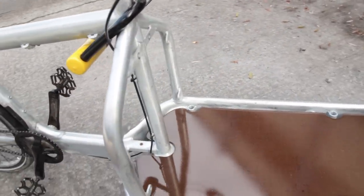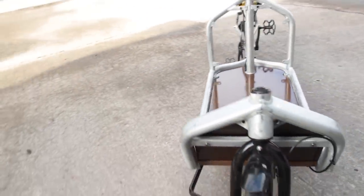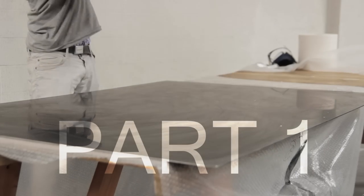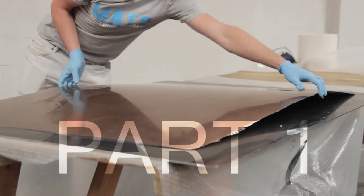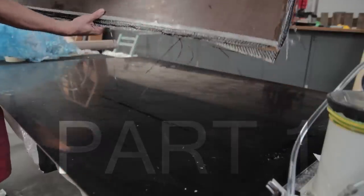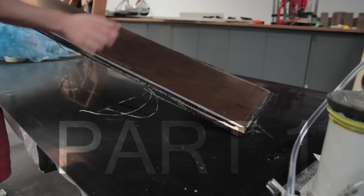Hi everyone and welcome to this three-part video. I've decided to make this series in three parts just to make it possible to digest all the information in a better way. In the first part I'll explain how I made the jute plate — a Biotex material — creating a plate using resin infusion, then bonding it with a honeycomb core in between to get good surfaces from both sides. This will become a stiff plate used to make a bullet bike board.